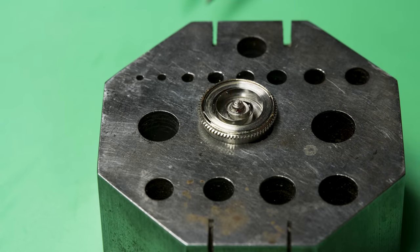I use an air blower to dry off the parts. Then I need to put a droplet of oil on the cap jewel — not flooding over the side, but enough to properly lubricate the watch. Now for the really tricky part: I lay the cap jewel on a little bed of Rodico, put the balance bridge on top lined up, being careful not to let them rub around and displace the oil, then take those tiny dust-sized screws and secure the bridge to keep the oil exactly where it needs to be.